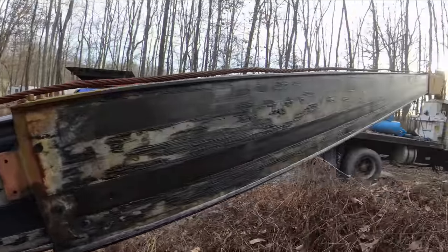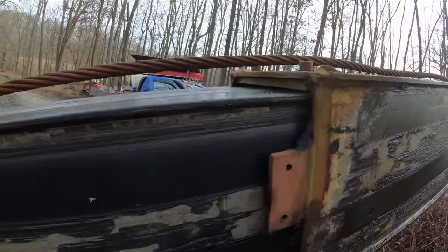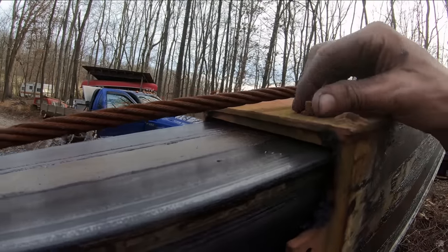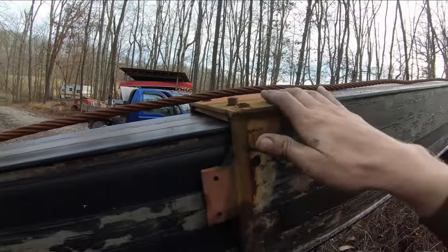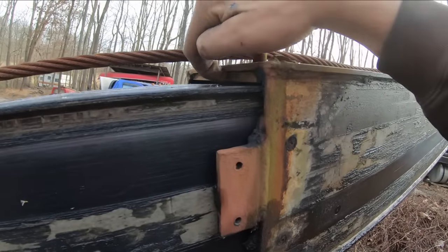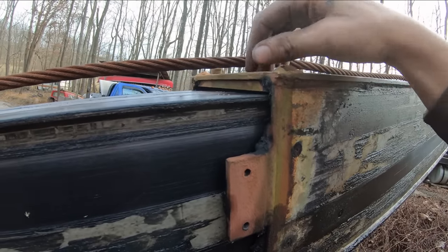All right, I've checked the boom over real good on both sides, well, all sides, and the only thing I'm really seeing that's not wrong, but maybe looks a little out of spec, would be these. There should be brass inserts in here, I'd imagine. I used to build sliding jacks like these for mines, and you'd have to shim out these spacers and the guides, whatever you want to call them, in there. I'm not sure what the spec is on these.